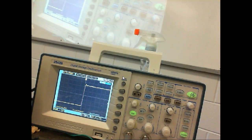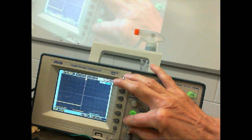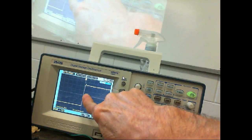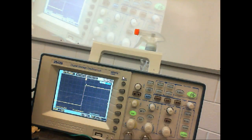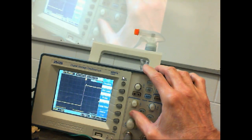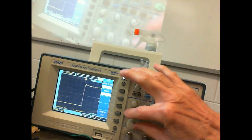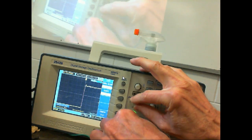Turn off channel two. Then what I would like to do is get these guys on even terms. I would like to have it there and there, right? You understand? So what I'm going to do is take this knob here and put it on fine. And you notice what I can do now is raise it just a little bit at a time.